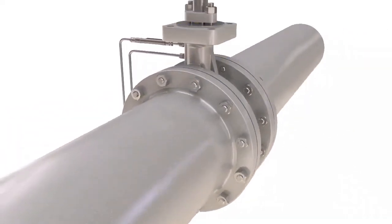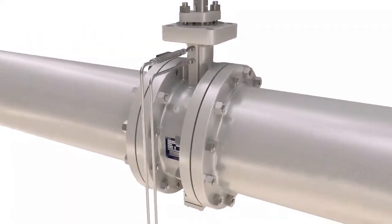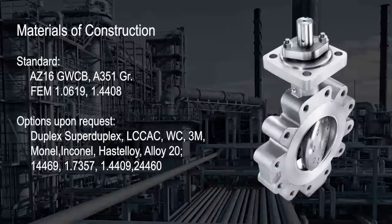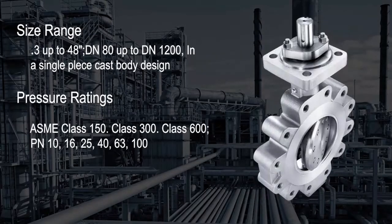As an added option, two ports were designed into the shaft seals. The first is a monitoring port that enables leak detection for safety reasons, and the second is a flushing port for cleaning the stuffing box area by allowing the purging of contaminants.